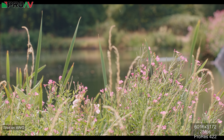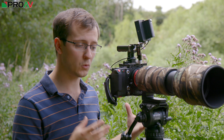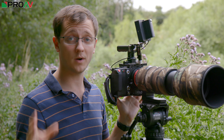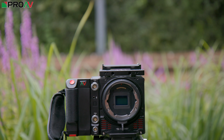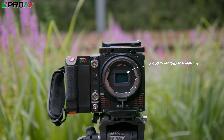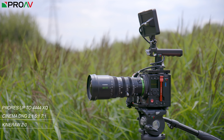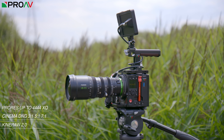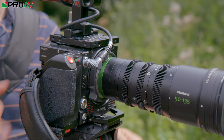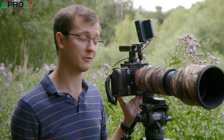So what really makes these cameras exciting for me is the image quality. They are essentially small cinema modular cameras, and this is the Mavo, so it's the middle one of the lineup. It's got a 6K Super 35mm sensor inside it and it can record 6K up to 50 frames a second in either ProRes up to 444XQ, or in raw in Cinema DNG or their own KRW 2.0 files. Most people I think are going to be using the ProRes — all the stuff you'll see in this video so far is ProRes.